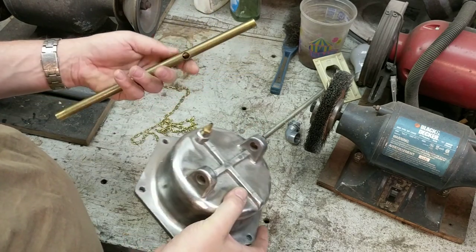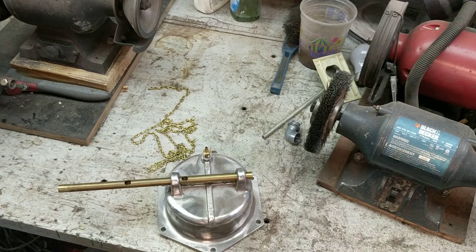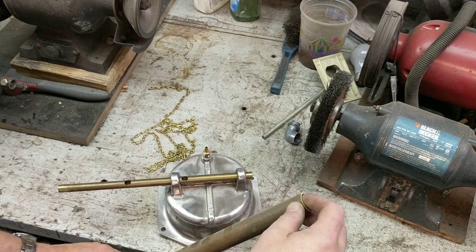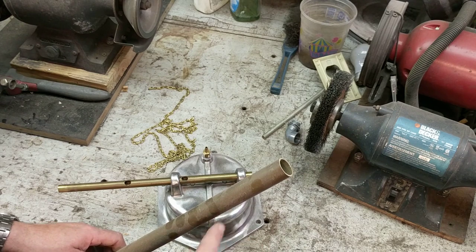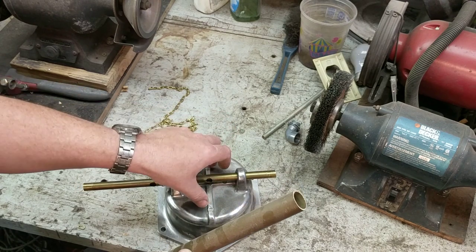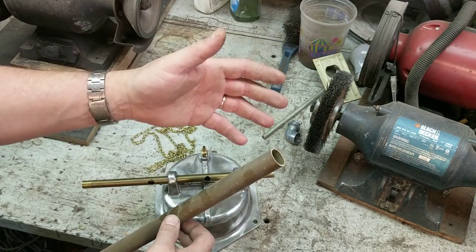The housing has these nice lugs with holes in them, and it happens that this brass tubing fits these lugs - that seems like a slam dunk. The question remains how to bring it on up. The direction I'm going is I have this brass pipe from an antique store - twelve dollars for a six-and-a-half foot length of fairly heavy-walled brass pipe that is the same OD as three-quarter inch water pipe. I can actually thread it and treat it like pipe. We're going to take a length of this pipe, carefully drill it for the ID of the tubing, and make either a fixed or swivel fitting. From there, I'll probably thread this end to screw into the fitting at the end of the swing arm.